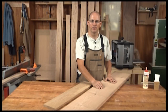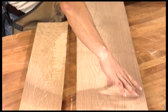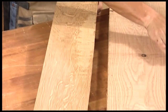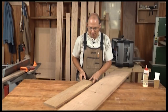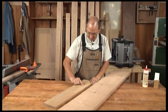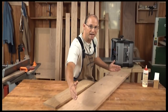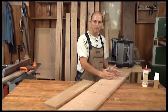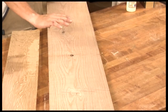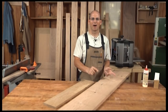The way that lumber grades are determined is how big of parts you can yield out of a larger plank. I can get a nice piece by removing all the knots, but sometimes by the time I plane it down — because there's so much twisting in a board — some areas may not have all the mill marks removed. So instead of cutting a 60-inch board to get three drawer faces, I'm going to cut three 20-inch pieces in a row. I'll mark them and index them to keep them in line as I go through my milling procedure. It allows me to yield more parts out of lower grade material.